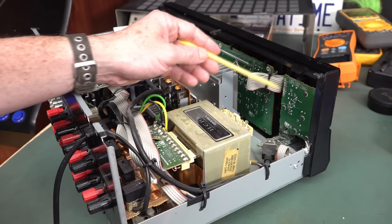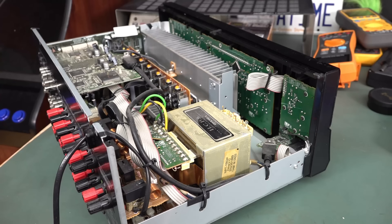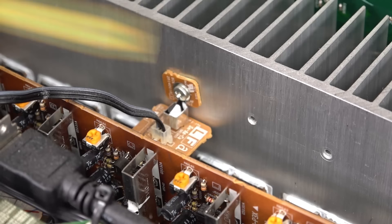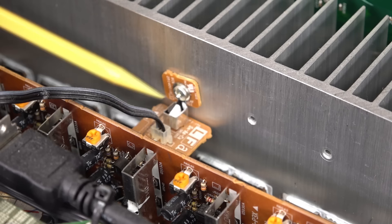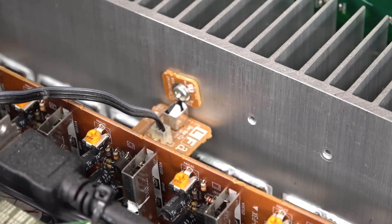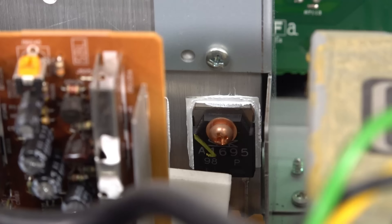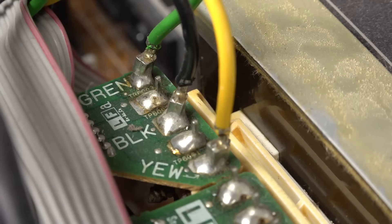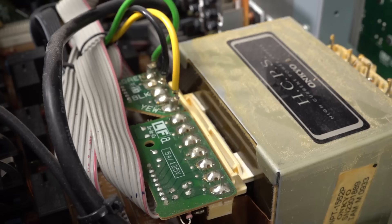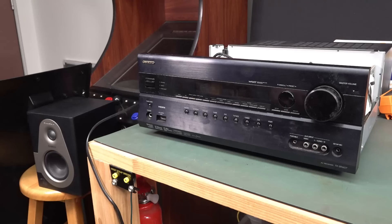That's rather interesting. We could maybe be looking at just a display fault, perhaps. Maybe I could feed in an audio signal and see if something comes out. Well, there's nice attention to detail — look at that. They've gone to the effort to design two PCBs just to hold the temperature sensor to measure the heatsink there. One little board just to hold the screw, which is presumably strapped down to the metal part, which is then thermally coupled into the TO92 plastic temperature sensor. They've gone to quite a bit of effort just for that. There's the power transistor in the back there, and it's labelled collector, base, emitter — none of that gate rubbish. Right off the bat, some of those solder joints on that transformer PCB interface there — they're dry as a dead dingo's donger. So I think it's worth just taking one minute to re-solder those. That didn't help the display, but it made me feel better.